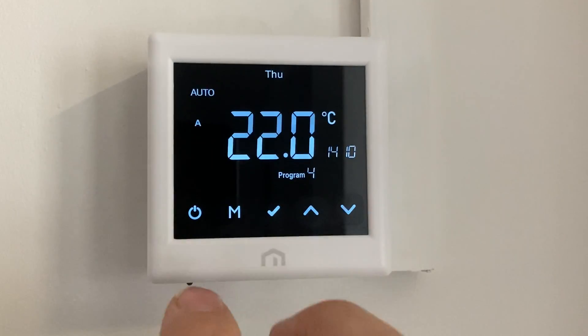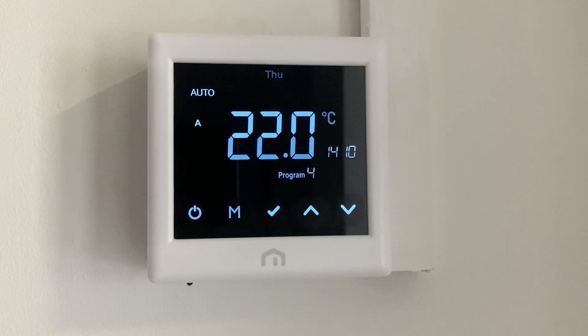So that is a program now that has been installed for the full seven days. It's very simple — basically 21 degrees from 6:30 a.m. to 10 p.m. at night, which typically covers most situations. If you are leaving the home unoccupied for most of the day, you can set back the room temperatures as long as you put the heating on early enough for it to recover. But really the property — especially if you've got a new build — is going to benefit from just staying at a steady state. The heat pump prefers to do that, and just let the slab cool down overnight a little bit so that it's not working round the clock. In most cases that will be sufficient.